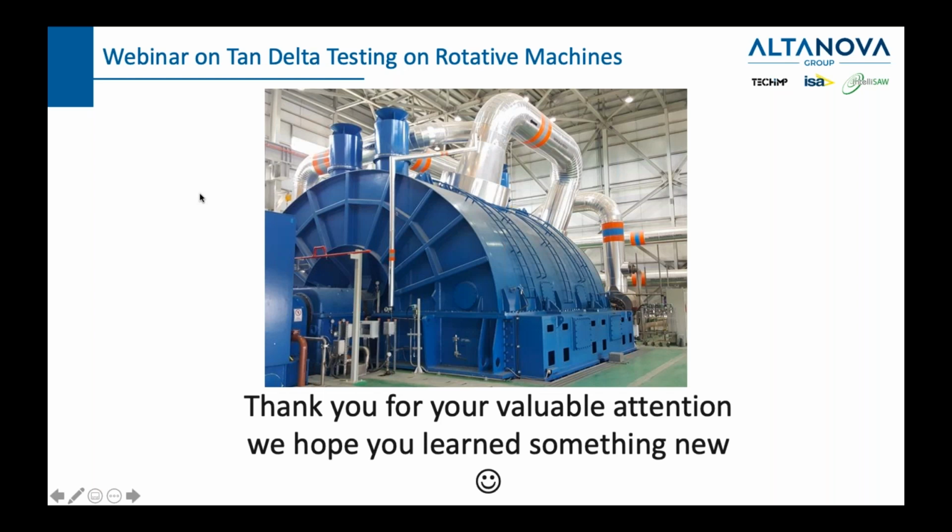Well, the equipments used to measure tan delta are STS 5000 plus TD 5000, where the STS serves as the brains and the TD 5000 as the high voltage generator and the measurement of the current, or TDX 5000 are for tan delta. And for PD, we have Aquila, Micro Aquila, PD base 2, Alpha. We have different types of acquisition units, and depending on what type of asset we are talking about, we will provide you with different types of sensors. So feel free to contact me later. You will see my email, or contact directly the distributor in your country if you have a need for something like this, because for tan delta we have basically 2 types of devices, and for PD we have many other types of devices.